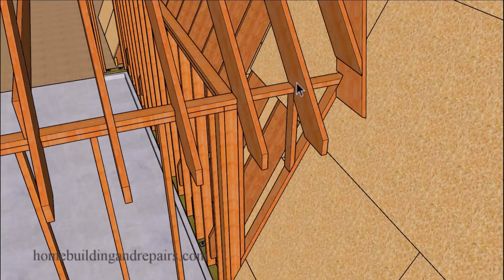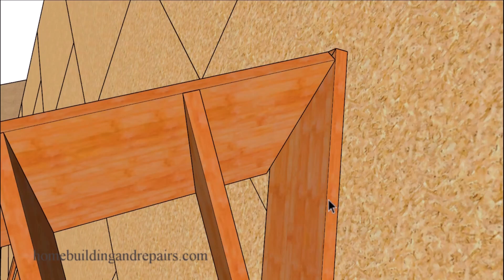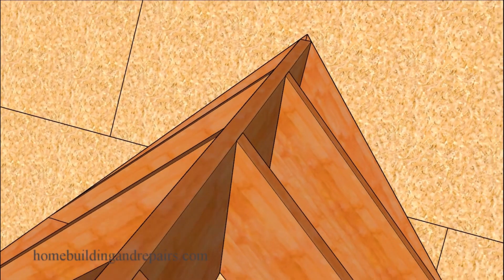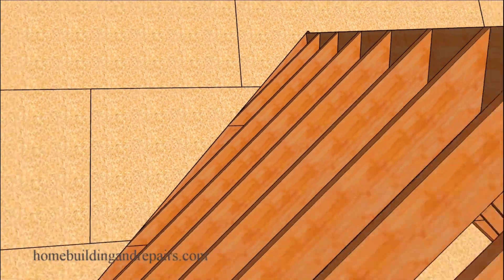I went ahead and put my stud underneath the rafter since I'm going to have a single plate here. If you want to add another plate, the wall stud doesn't need to be directly underneath the rafter. I went ahead and had the ridge sit on top of our support boards — you can have it sit on top of the sheathing, but I did it this way to show how these support boards form a peak. Some engineers would rather have the ridge sit directly on top of the support boards instead of the roof sheathing, especially if the ridge won't be sitting on top of a rafter.